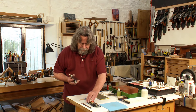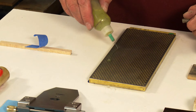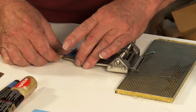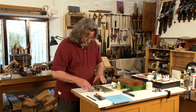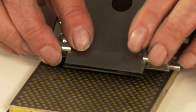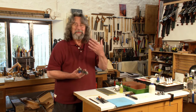Now I can go to a finer stone. Without taking this out of the honing guide, I can put it on the prop and just do a very few strokes — that was five tiny little to-and-fros. Having done that, the wire edge will have been pushed back to the bevelled side where I can feel it. So I'm going to do five very gentle strokes, possibly even three. The wire edge flips back to the other side.